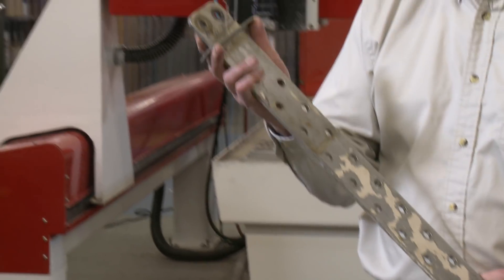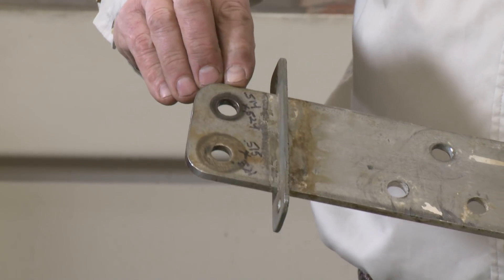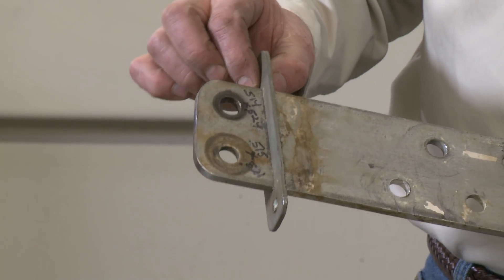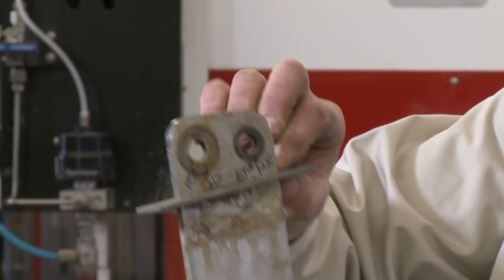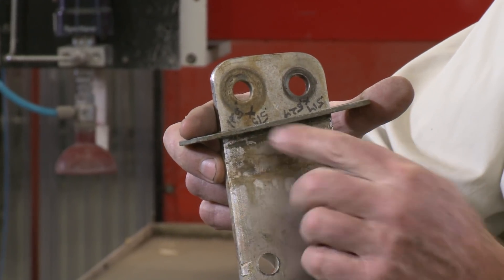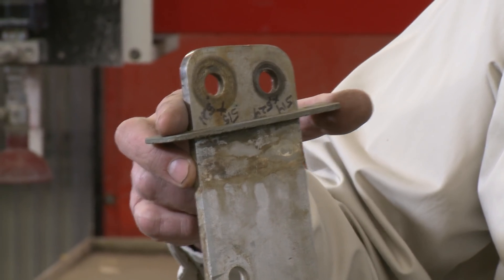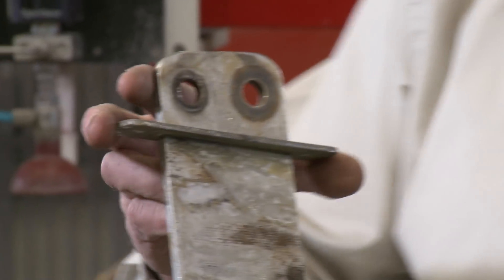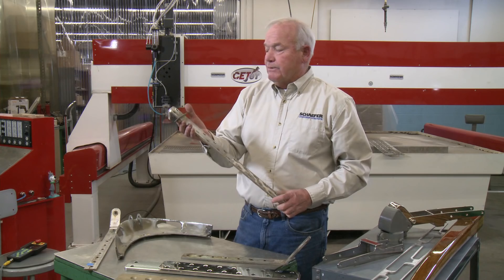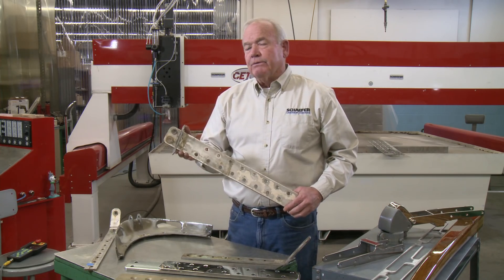This is one of the old chain plates — actually the better of the two, but both had the same problems. We have elliptical holes and mushrooming on top indicating wear and overloading. The deck plate cover protected the fitting, and in that area was where the plywood deck core was. Water had been getting in there, rotted a bit of the deck core, and gave salt water a place to sit against the stainless and start corroding. We're still not convinced we know what the material was — it was very common for production builders at that time to use 304 stainless steel instead of 316. We've found that 304 is a little stronger and more economical, but it doesn't have the corrosion resistance of 316.